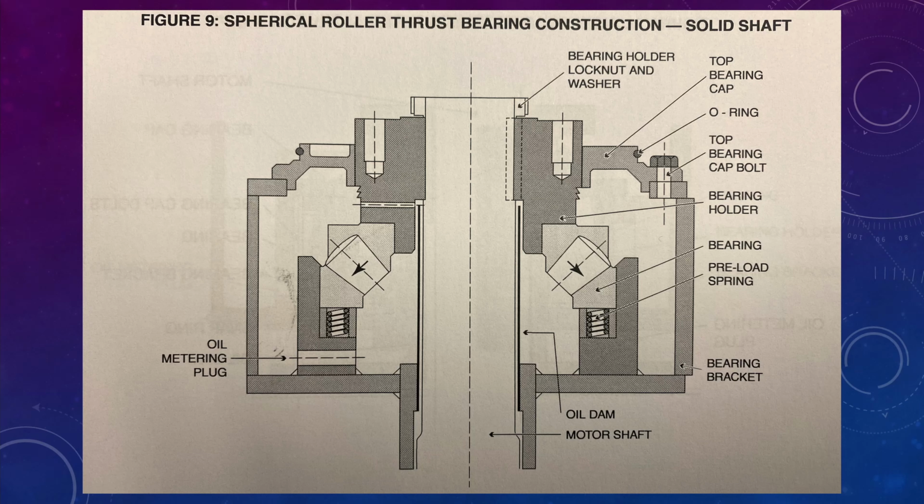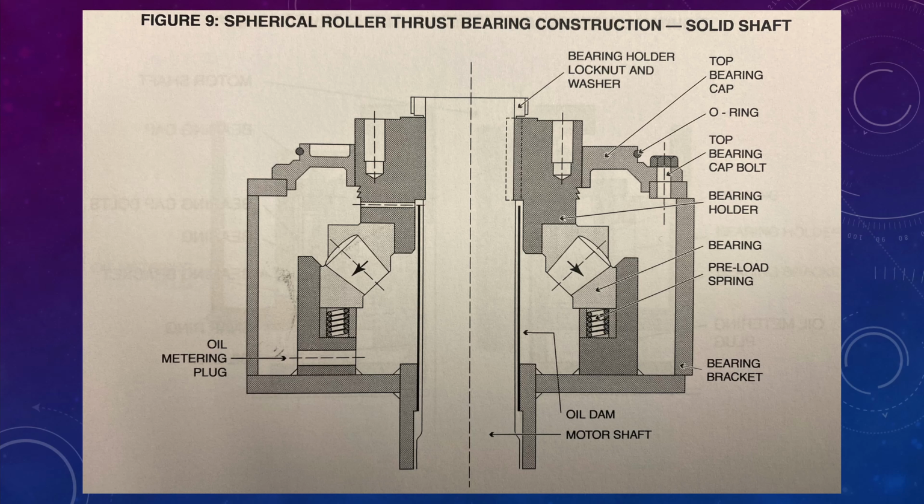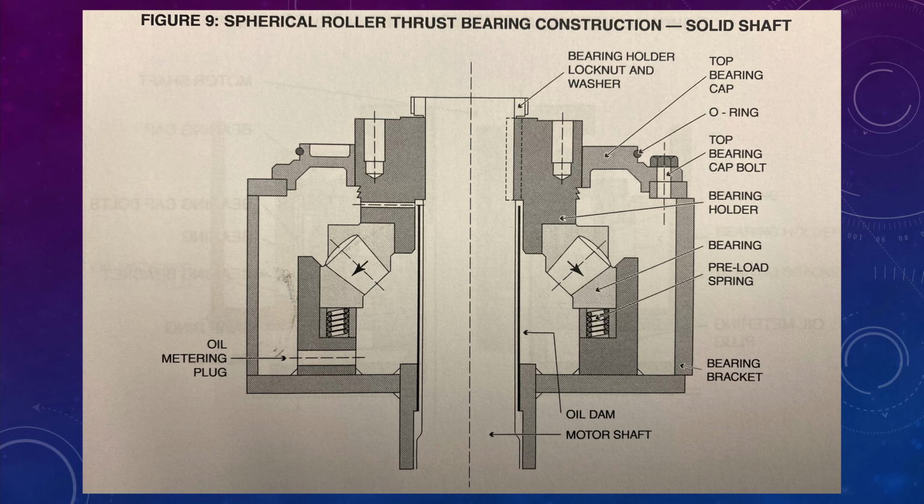We're finding out up here that it's pretty tough if you don't put the seal cover on, and that's the large cover that goes on top of the end bell that has all the small bolts in it, basically keeping the oil from slinging out, that these housings flex. So when you've got a dial indicator sitting on your bearing carrier and you're trying to set your end play, you can get numbers all over the place because the ears are going like this and the whole casting is moving on you. When we put the seal plate in, we don't have to put the glue on it or anything else. You're only doing it for the end play, and you throw some bolts in it real quick, it stops doing that. It still may do some, but it's nowhere near as bad. So it's recommended to put the seal cover back on it. Take your measurements with that on because you won't get as many false readings.